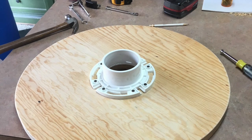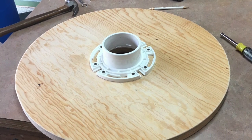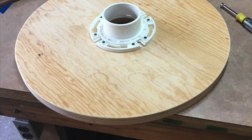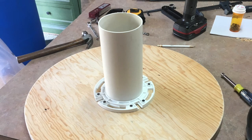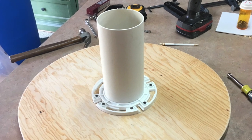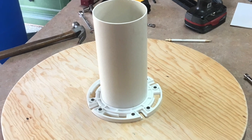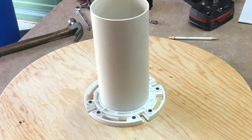We are back to the cap. It doesn't look round but it is — it was cut out with a bandsaw jig. What you're seeing on top of it is a toilet flange that you can pick up at Home Depot. I have 74 feet of 4 inch drain pipe — it is not schedule 40 but the thin wall kind; it's lighter and still does the same job, and the thin wall pipe fits over the toilet flange. I also took the router and used a 45 degree chamfer bit and routed a 45 degree on the inside of the hole, thus making a funnel. Then you put the toilet flange on the opposite side, screw it down, and that way you know where to put it after you've got it painted.